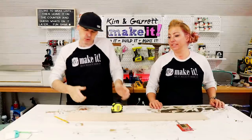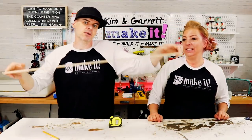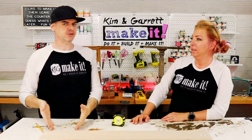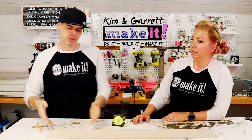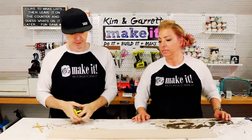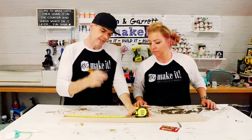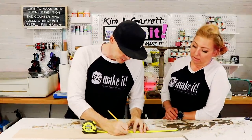Game number three: a little quarter toss. This one's super simple — it is the easiest one of them all. Step one: gather all your supplies. You really just need this quarter-inch piece of poplar — it's a five by 36. Step two: make all your cuts. It's like two cuts. We're going to measure down 11 inches — a cornhole board is like two foot by four foot, so this is just scaled down. If this is five and a half inches wide, we measure down 11 inches — double — and then give another two inches for the feet. And we're going to make two of these.